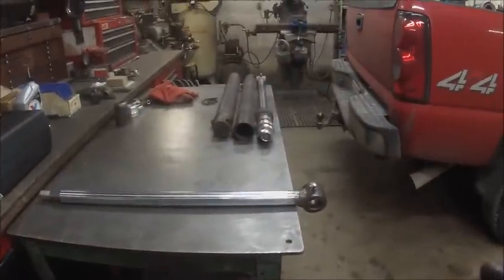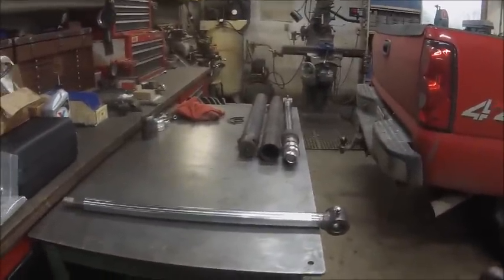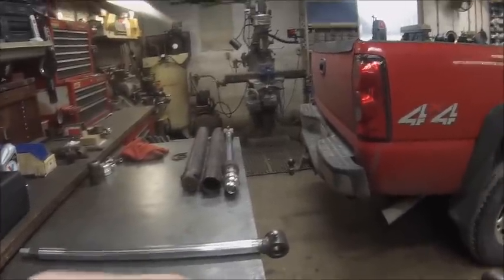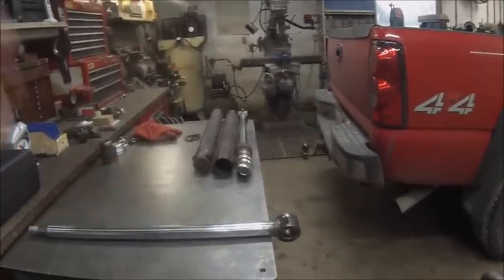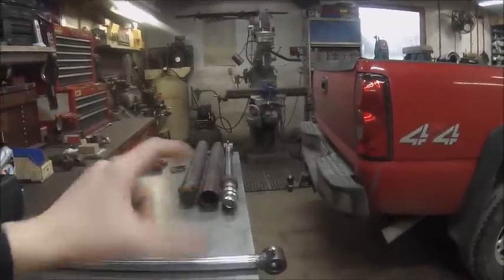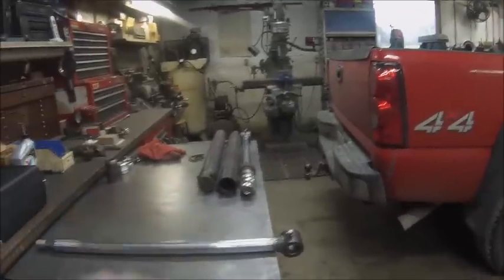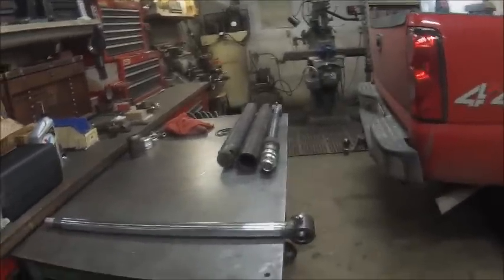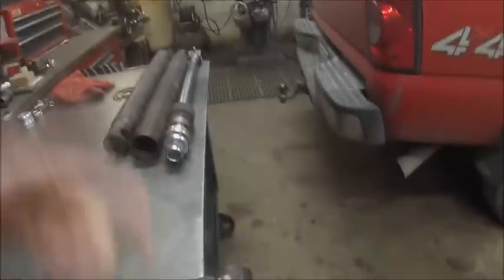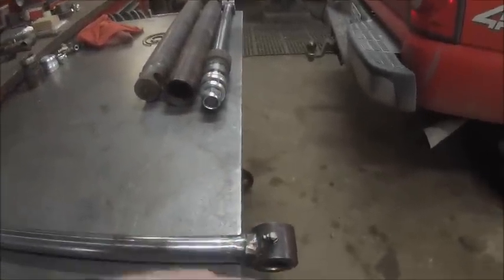Okay, so first things first, you've got to find out exactly where the rod's bent. In a case where you don't have a clevis on the end, like if the clevis is threaded on and you take it off, if you don't have some way to locate which way the rod was in the cylinder, you've got to roll it on the bench and figure out where your high spot is. In this case, the rod was only going to be in the bucket one way because the grease zerk has to face out and the eyelet is welded to the rod, which this one's actually been broken,